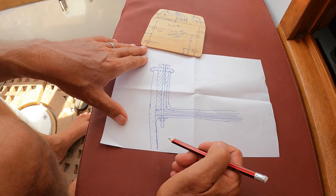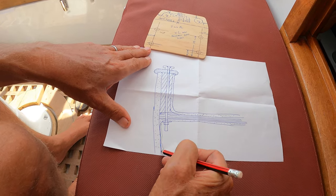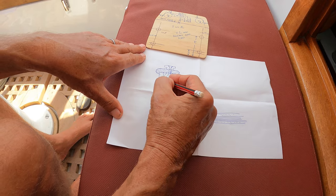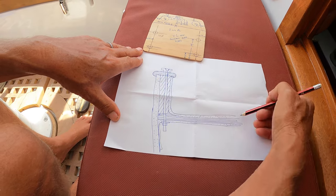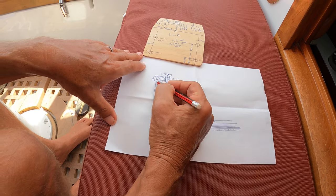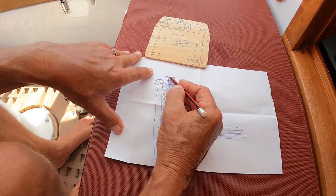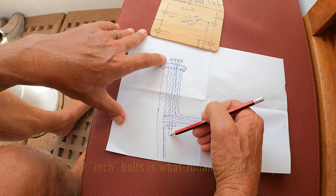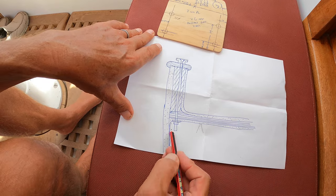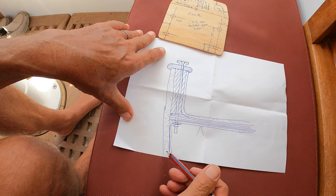This is a cross section of the area we're talking about. There's a plywood core to the deck; the underside is glassed into the hull. On a Peterson, the hull top is about half an inch — 12 millimeters — thick. The bulwark is formed by the inside molding of the deck dropped into the hull, with the gap filled with plywood. The teak cap rail is a decorative covering piece. The track is bolted with eight or nine millimeter bolts going all the way through the bulwark and bolting up inside the hull. These have either corroded through or left stains running down the inside of the hull.